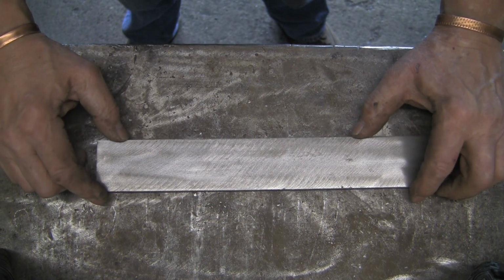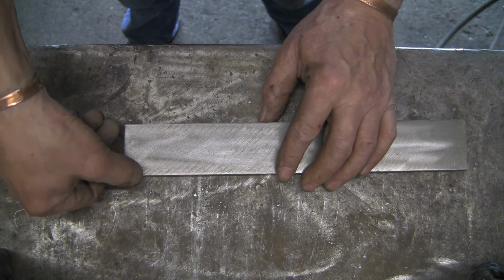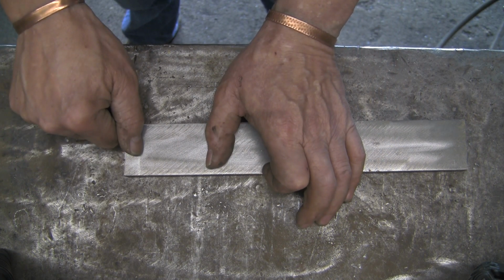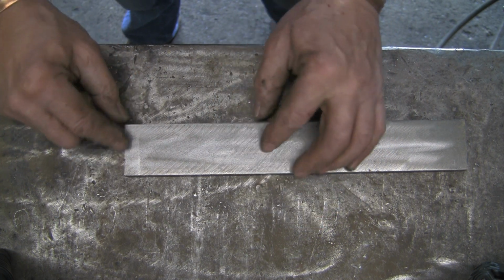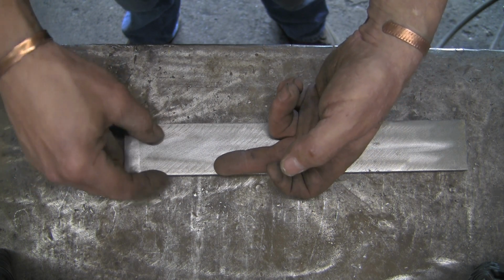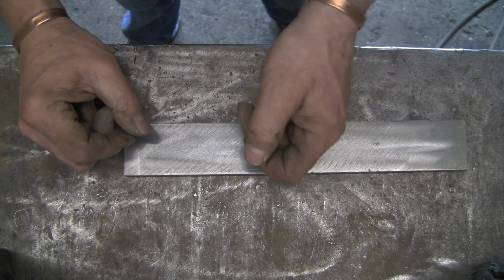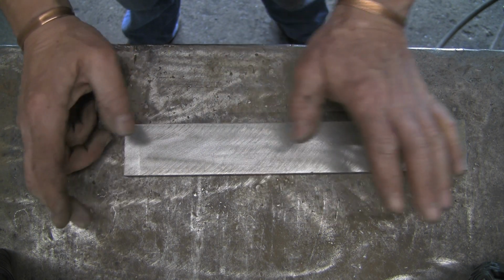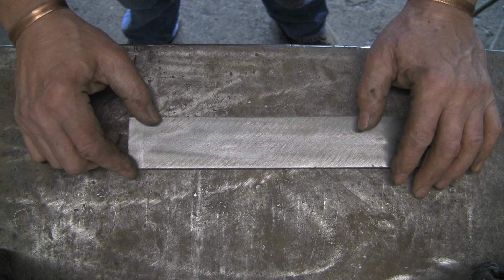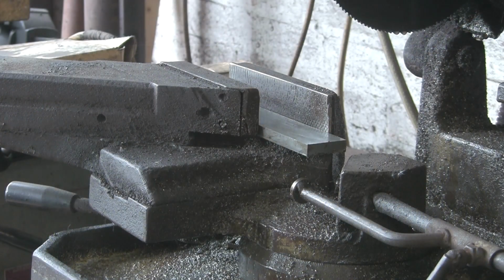What I'm going to do is slice about 15mm off one end, obviously, and then two bits 15mm actually, and then a bit of 40mm, and then I'm going to bolt it in at the top so that the middle bit can swivel without hopefully too much free play, and that hopefully will track up the belt.